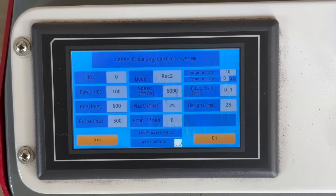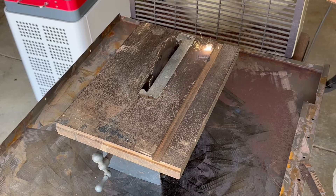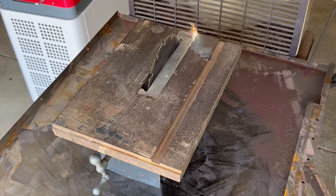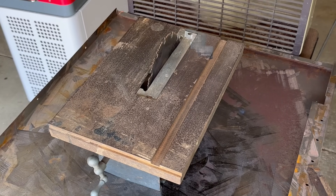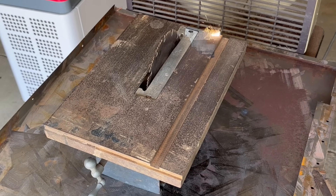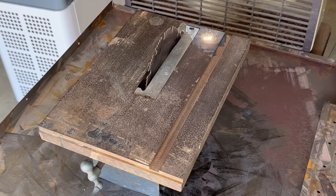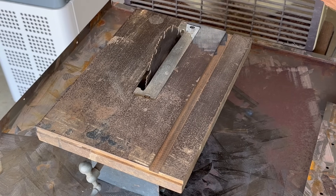Here's a quick look at the parameters I'm using for this project. This 200 watt pulsed laser cleaning machine is the FLC200 by Fortune Laser. I'll link a full video all about this machine in the description as well as a link on Fortune Laser's website. The biggest advantage of the pulsed laser is that it uses less power and makes less heat while removing rust, so it doesn't alter the original surface of the metal. That makes it ideal for removing rust, paint, oils and grease from a variety of applications including thin sheet metal, aluminum, stone, concrete, and even wood.